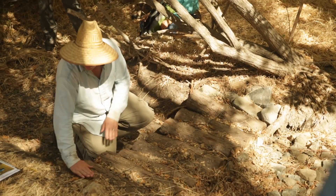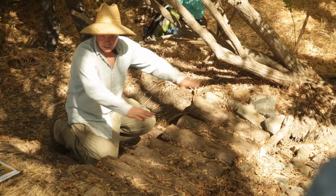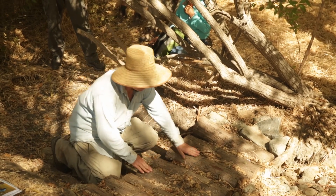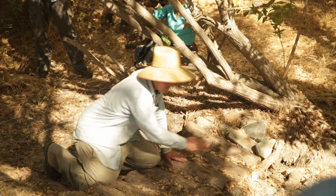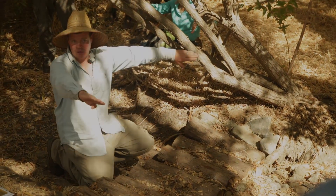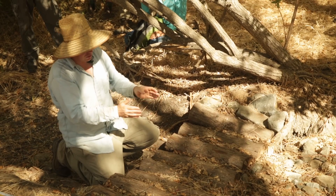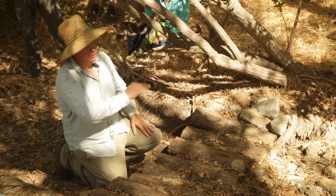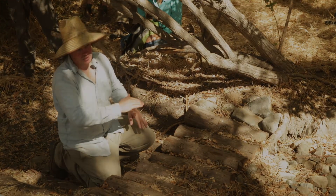The top elevation is tied in flush with the banks. We don't want anything to flank it — that's a no-no. We want all the water to go over the structure. You'll notice that it tapers down to the center of the channel and back up, so it matches the shape of the channel we're looking to create. We want the water to hit it and just flow smoothly over the drop — force the water over the drop but have it move smoothly. We're not using a drop structure to grade the channel; we use the grade control structures to do that.